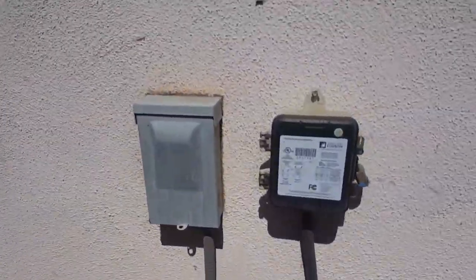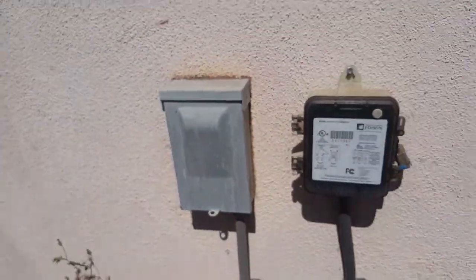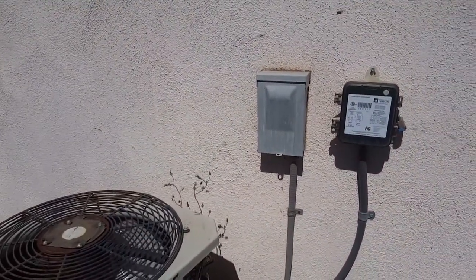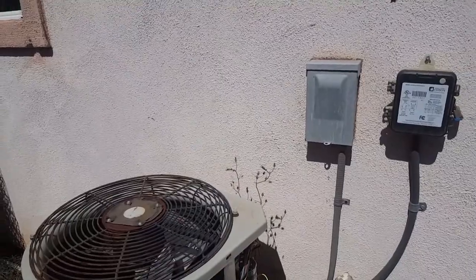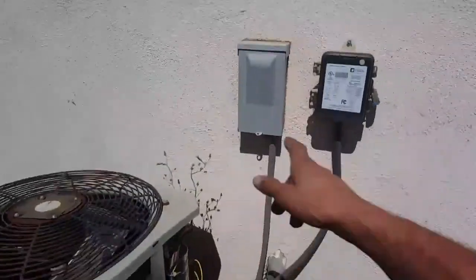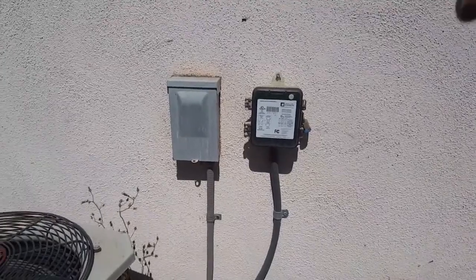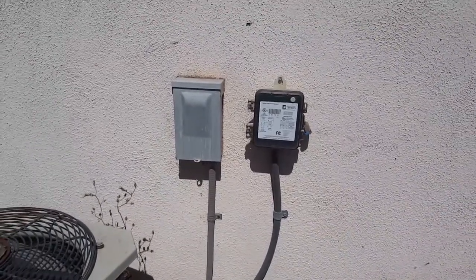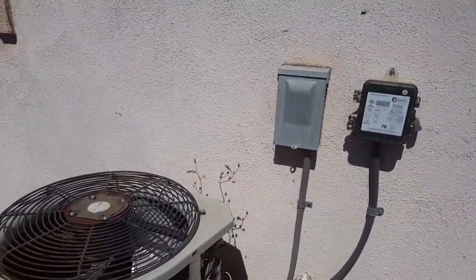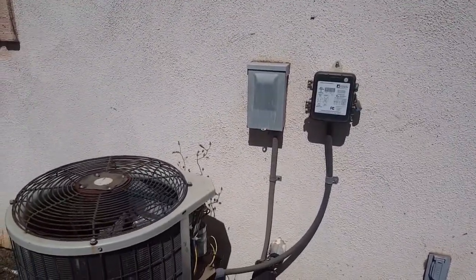If you're a Southern California Edison customer, you can take advantage of this little box here. It's called the discount saving plan. You allow them to basically shut this thing off a couple times a year and you get awesome credits. They come out and put this box in — it's all wireless. They'll have an energy saving day, trigger an event, usually about four hours. They'll send a signal and this will cut the compressor off. The fan will still work inside, but the compressor gets cut off until they turn it back on — usually between about four to eight towards the evening.